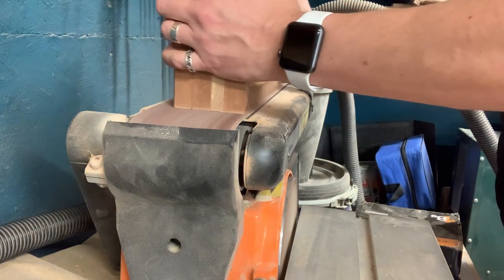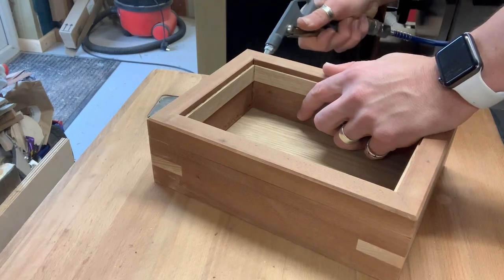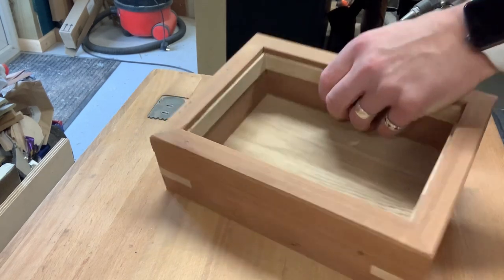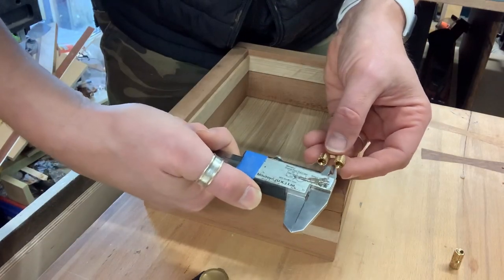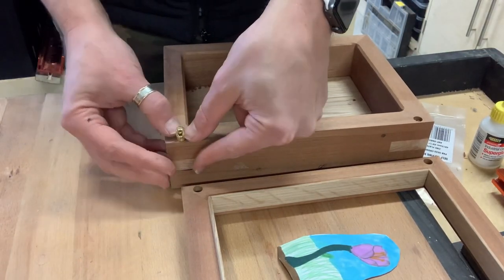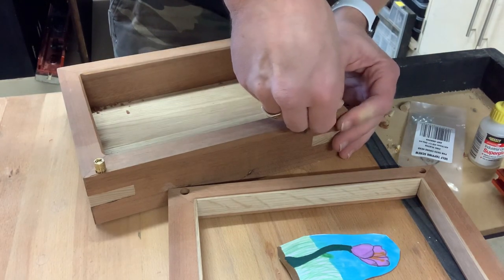If you are going to sand a box like this, make sure you do it with the lid in place — it's quite easy to sand too much and then your lid doesn't line up properly. I'm blowing the dust away so the finish isn't milky. These are barrel hinges — first and possibly last time using them. I'm measuring the gap in their open position so I can halve that and set the centre of the holes, placing them that distance plus half the barrel diameter away from the edge to get a box that opens 180 degrees.